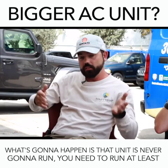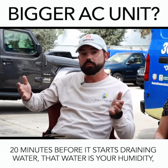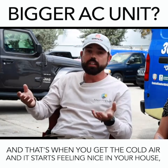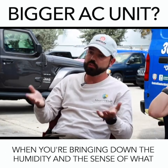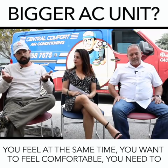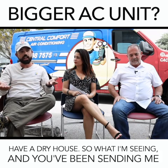What's going to happen is that unit is never going to run long enough. You need to run at least 20 minutes before it starts draining water. That water is your humidity, and that's when you get that cold air and it starts feeling nice in your house — when you're bringing down the humidity and the sensible heat, what you feel at the same time. You want to feel comfortable; you need to have a dry house.